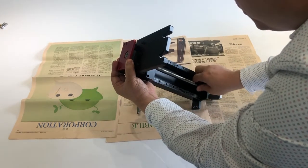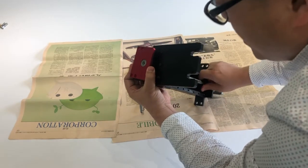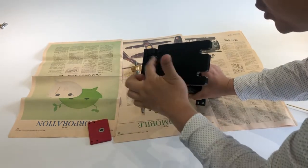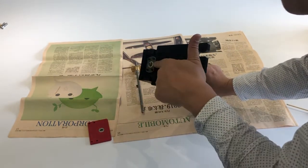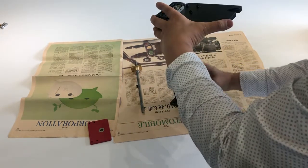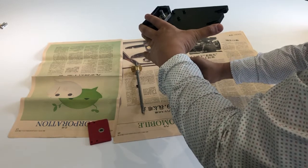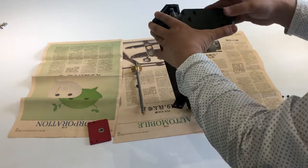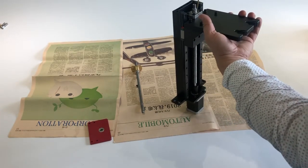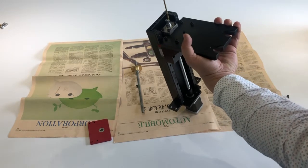Push it out — can you see? The top. And never, never take this screw off because there are many balls inside. After the first step, you need to move it down a little bit to protect the balls from falling out. You can keep this ball screw in your stock. Once you have an issue with the new screw, you can turn back.